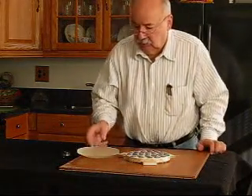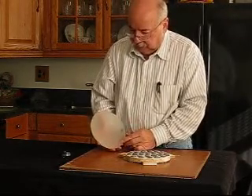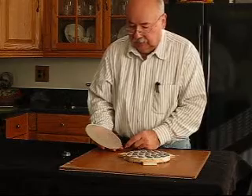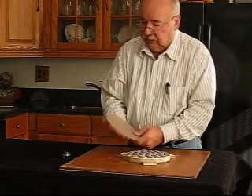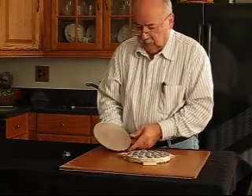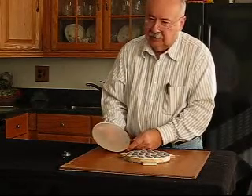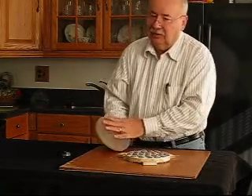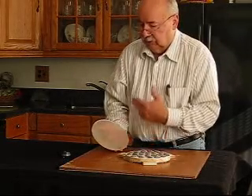I've spent about 12 minutes running this mirror on 40 micron, and now the question is whether to go on to a finer grit. If this were a lens, definitely not — I had about 80 microns of wedge which I haven't eliminated yet. That's too much; you need to have well under 10 microns of wedge to go on to a finer grit. For a mirror it doesn't matter as much — you could probably have a half a millimeter of wedge — but for a lens you've got to fix the wedge before moving on.